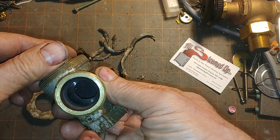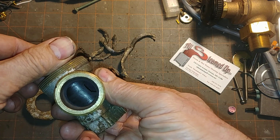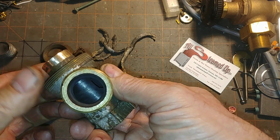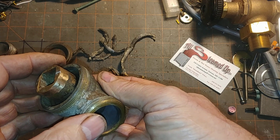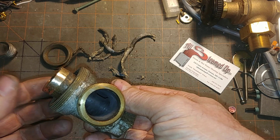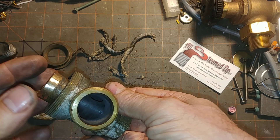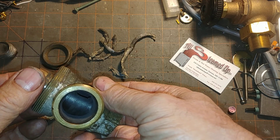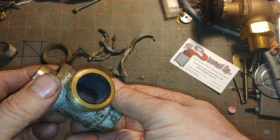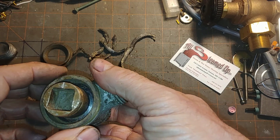That's going to be generally way too much steam entering the radiator somewhere there. For average-sized radiators it's going to be a matter of experimentation. As you adjust one, the others will have to be adjusted. The goalposts keep moving, and every change you make on this may have an effect on the system throughout, sort of like ripples spreading out from a pond.